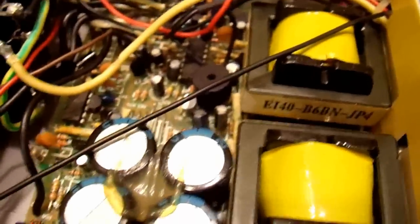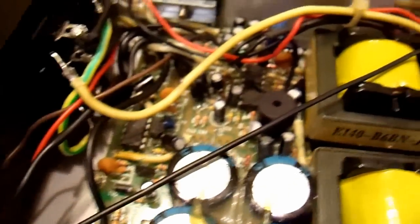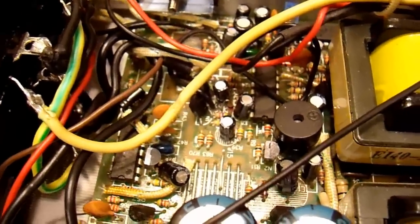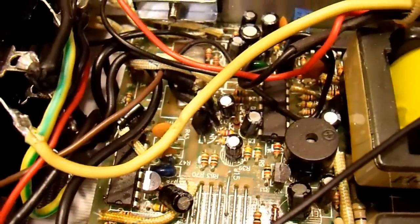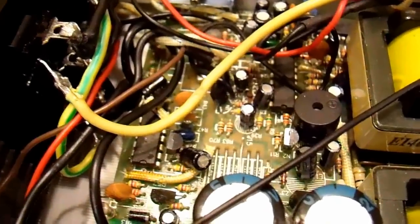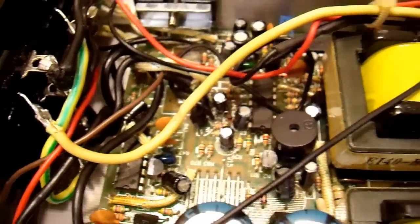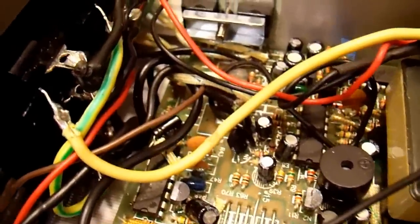I also don't like these electrolytic capacitors over here — these little ones dotted all over the place. Those are for control circuitry: probably five or twelve-volt caps for timing the buzzer and all kinds of functions like that. But those really should be something other than electrolytic. They will fail eventually and you'll never know which one it is — you won't be able to fix it. It's just a matter of time, because they're inexpensive Chinese capacitors. In my mind, that's not really excusable because it only costs a few cents more to get good ones.